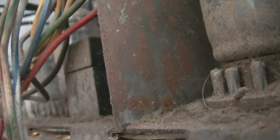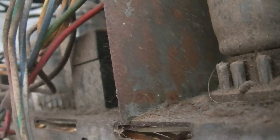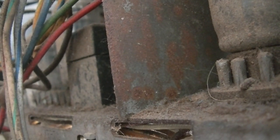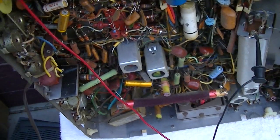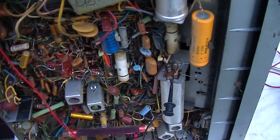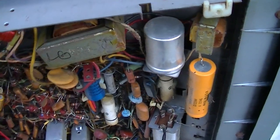And these fuses are open, and that must be the smoke that I heard. This thing sizzling and smoking must have been what I witnessed. So we need to get a new cathode fuse, or just jumper a glass one across the bottom to save the appearance of this fine specimen of a rusted Zenith 14 DC 15.